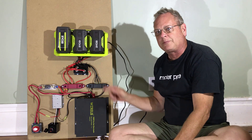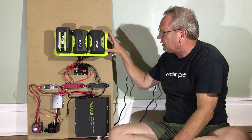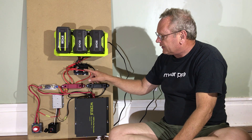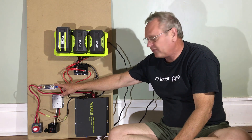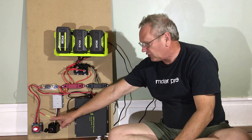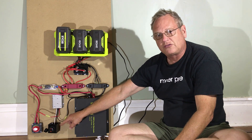So this is my test setup - something you could put down in the basement for emergency power. It's got three 4 amp hour 40 volt batteries in this supercharger that's plugged in, so they'll all be being charged. They go to three blocking diodes, then into a termination strip that goes through a 60 amp fuse, and that goes over to a 1500 watt pure sine wave inverter. It also goes to a power switch that goes to a 30 amp 13.8 volt DC converter that drives a cigarette lighter socket. You could probably put three of those in.